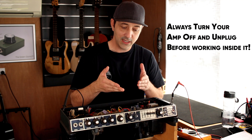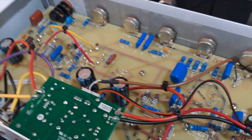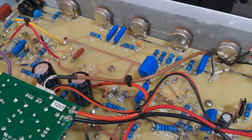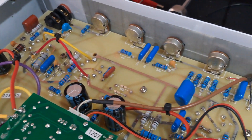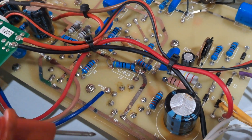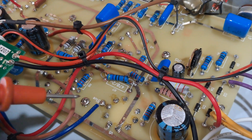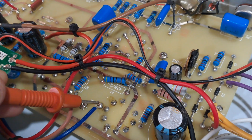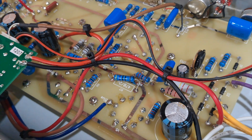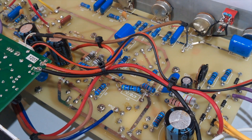If you're ever removing components, check for lethal voltage before you even touch them — just be absolutely paranoid. If you're inside a PCB-based amp and can't get to the filter caps because they're mounted on the other side of the board, drain from your power tubes instead. The power tube pins are right here, and you want to drain from those. The other place to drain from is where your output transformer connects. A good rule of thumb is always check your tube pins and everything you can for voltage — it's so easy for voltage to be hiding somewhere.